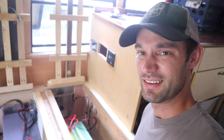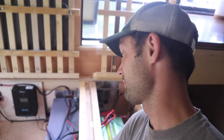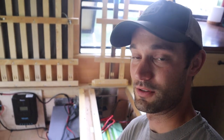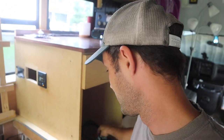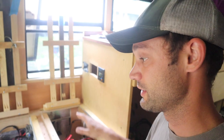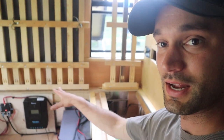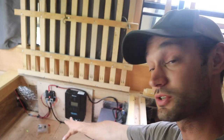Well, we worked pretty late into the night trying to get all of this system organized. I've now identified, figured out, and rerun most of the system. All I have to do at this point is finish up putting in this switch where all of her lights and LEDs are wired into. So I have to get that rewired into that section. And then essentially, I didn't really do anything new. I just replaced wires to new sizing for what she's got here. Ran it so that it's actually clean and put away so that she actually can use this section as storage at this point.